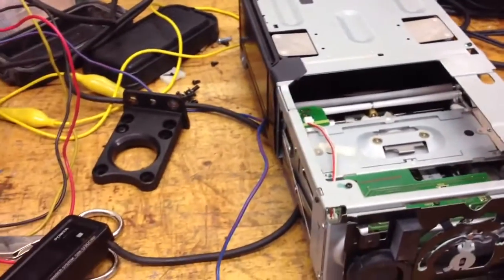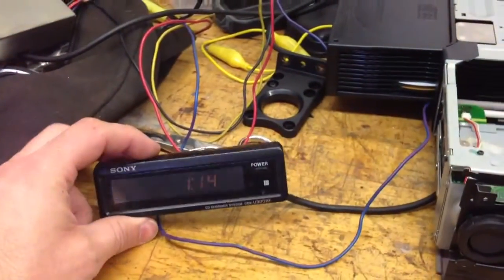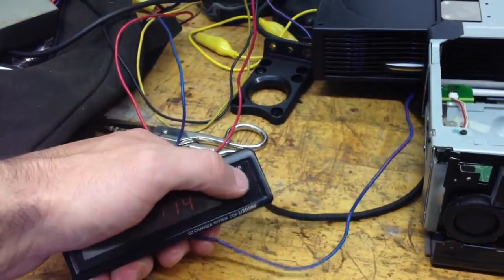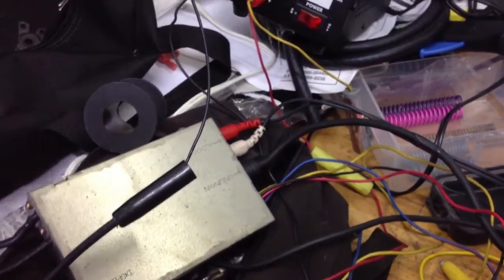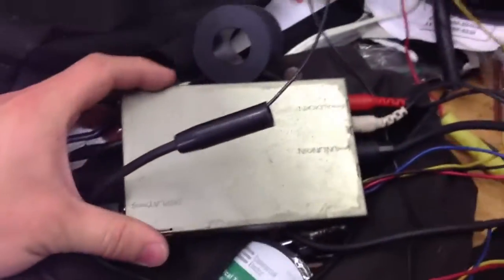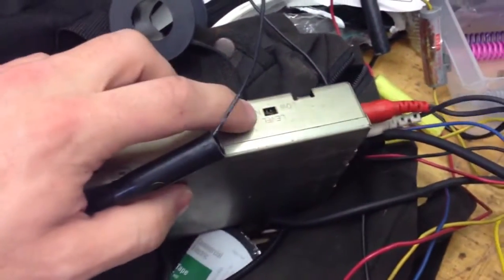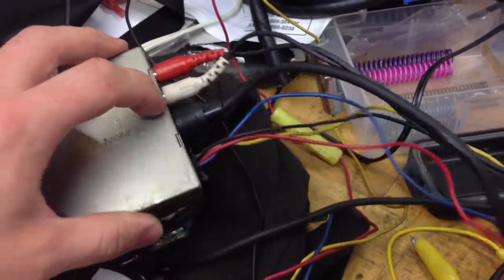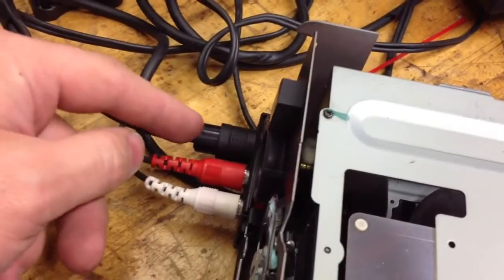You can hear now the radio has started back up. There's apparently an infrared remote that goes with this that would probably let you select discs and things, but I don't have it — all I've got is the hardwired items. With this setup I've got this little power supply, there's this control box which is an FM transmitter. There's a switch on the side for either 88.7 or 88.3, a power level, audio input, the Unilink — I guess that's the Sony proprietary connection — power, the display, and then on the changer you've got that Unilink bus cable and audio.